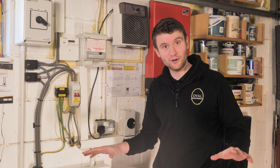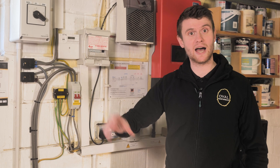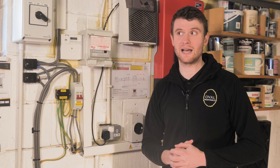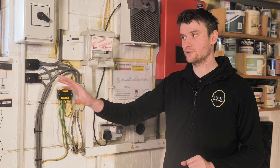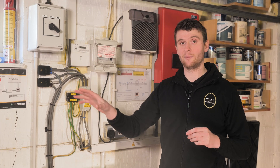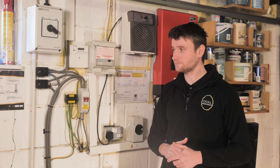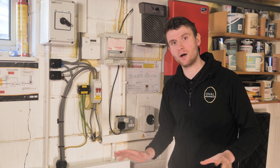We've now turned the power off, so we're still in off-grid mode. I'm going to turn this isolator back on, which tells the gateway that the power cut is basically over and it can go back to operating as a grid-connected solar and battery system. When I turn it back on, nothing happens immediately — the gateway doesn't want to switch back to grid mode straight away. It monitors the grid and goes through its setup procedures, so it might take five to ten minutes before it decides it's happy and turns back to grid connection mode. And the gateway has now done that — we're back in grid-connected mode.